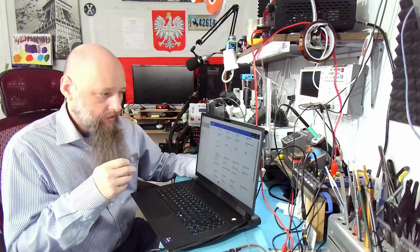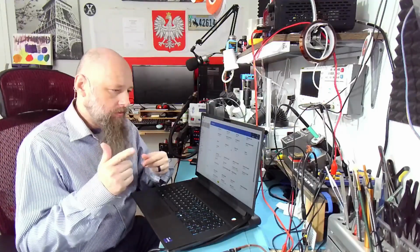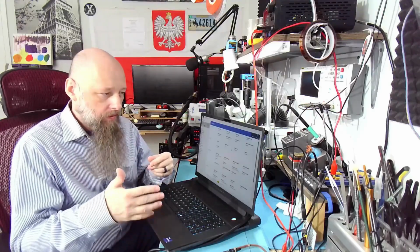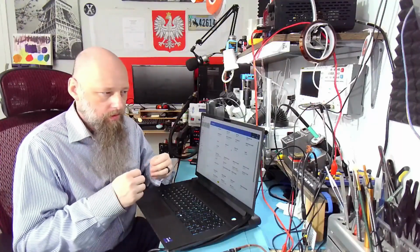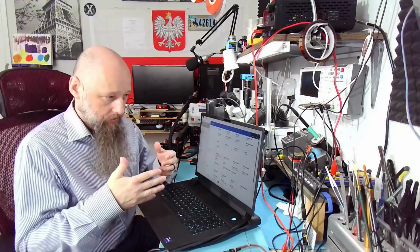The SAM chip is responsible for talking to the battery and talking to the system. It talks to the battery over SMBus, which is basically I2C. Other than the supported frequency, there's pretty much no difference. It's regular I2C communication, and it communicates with the PCH or EC or CPU or all three, and with the SPI bus. The system itself doesn't have access to the battery. The SAM chip has access to the battery and communicates with the rest of the system.